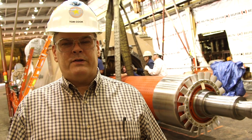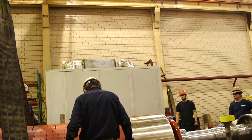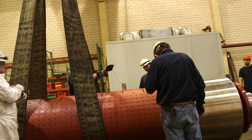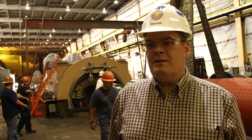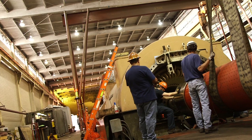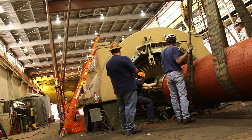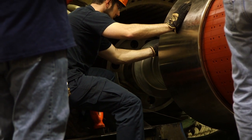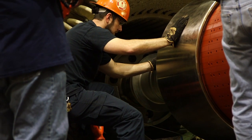Today, we're ending 14 weeks after the fire. What we're seeing right now is the installation of the Drake 7 generator rotor. The rotor weighs 73,000 pounds. Right now we're inserting that generator rotor — we go probably an eighth of an inch, maybe a half an inch at a time. They're going to be extremely methodical and careful to make sure that we know we're doing it right.